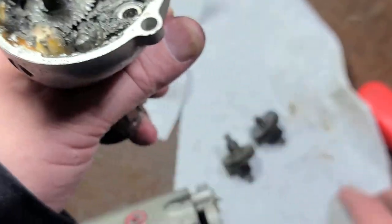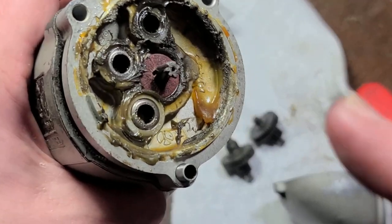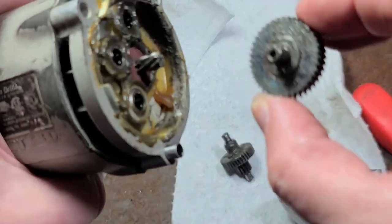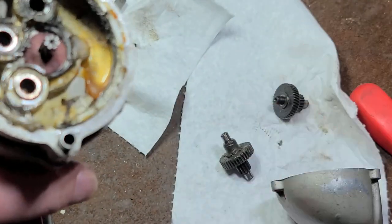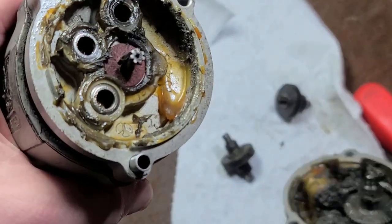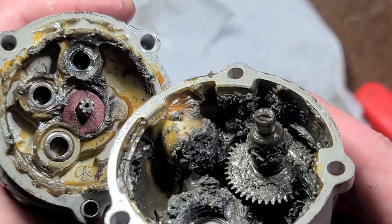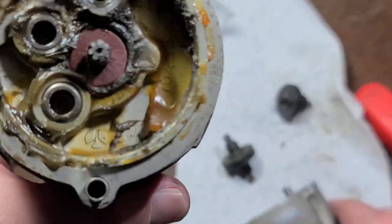There's a fair amount of grease in there — I'll refresh it a bit, get this back together, put a new cord end on it, and do a test run. Quick important note on Porter Cables specifically: since the motor is spinning this way, it's grabbing the helical gear and trying to pull it backward. That's why there's the thrust washer. And this little component is called a grease slinger — because if you put too much grease in, it can be an issue.